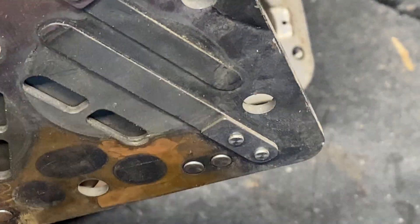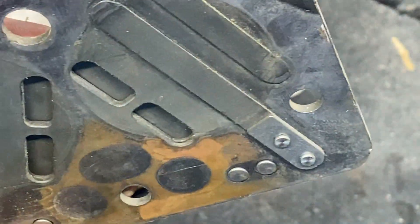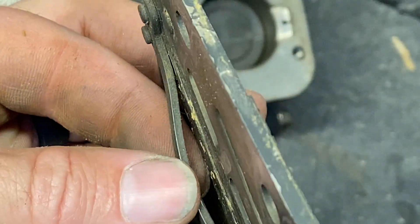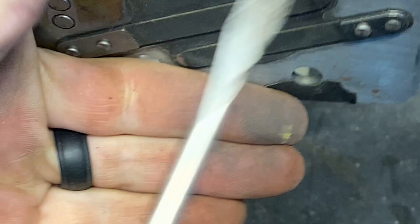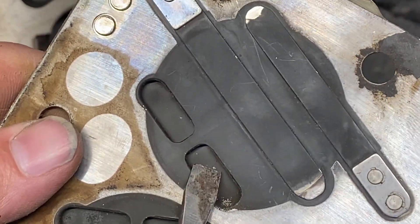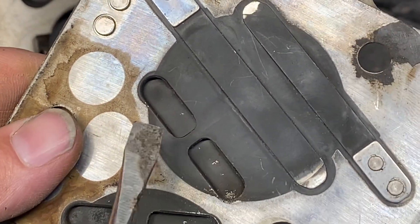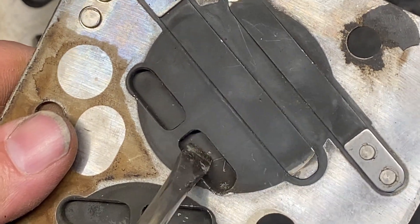When we get to the up cycle and start pushing that gas back up, the two suction valves close off — we're pushing against them and there's nowhere for it to go. As we push that gas forward, this one single discharge valve opens up. It has a special piece of metal in the back to help protect it from breaking, and this valve opens up and lets gas out, then closes, then opens and lets gas out, etc. You can see there are two intake valves and one discharge valve — because the suction side is expanded and low pressure, then we pump and combine all those refrigerant molecules together for high pressure, so it pushes out into a smaller pipe.